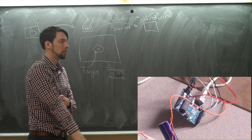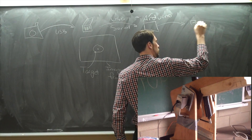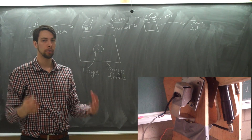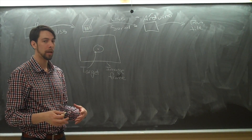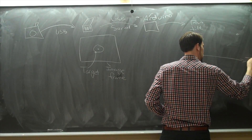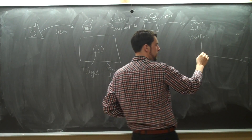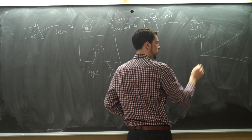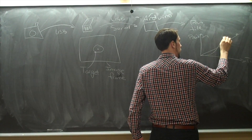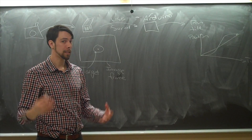The Arduino then passes via a serial link to the pan and tilt motors. These motors have microcontrollers that plot their own trajectory — a trapezoidal trajectory of time versus position. Instead of a straight line, they ramp up, accelerate, and then ramp down to reach the final position. This allows the motors to draw less power overall.